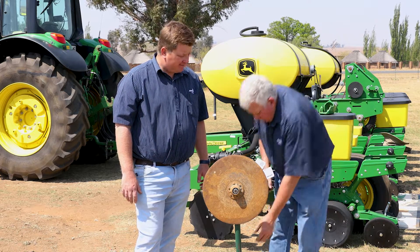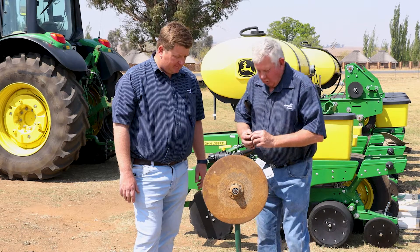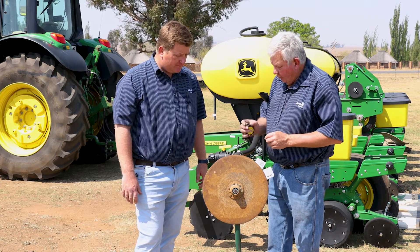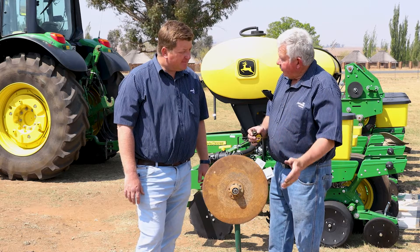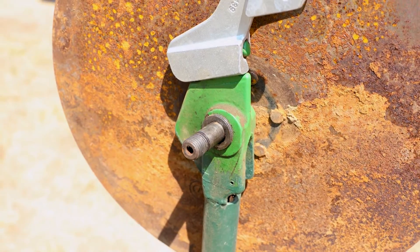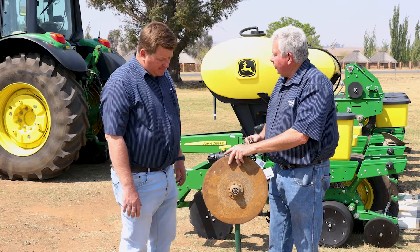To set it right, you've got spaces inside there. You've got a little bit of shims here and you can put shims on the left and the right side. That's very important — if you're going to put the shims in, if you put six on that side, you must also put six on that side. It doesn't work if you put only on one side, because then you can't lock this thing.